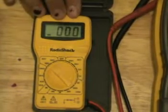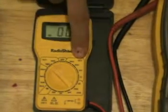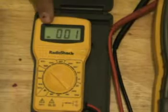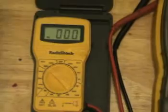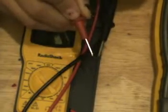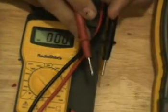For a little pocket multimeter, it's really nice. It can handle up to 500 volts AC and DC. It runs off of an N-cell battery, which can get kind of expensive — a bit of a drawback. It fits in my pocket. The amperage is a bit on the low side, but for general electronics use it's okay. I think I paid about $15–$20 for it. Definitely good for a first-time starter project. The probes are fairly nice — they have little grip stops so you can't go too far, and they have really sharp points, which are very important when dealing with fine precision electronics. If you're doing surface mount work, you don't want a dull tip. I've actually known people to go as far as sharpening their tips with a Dremel.